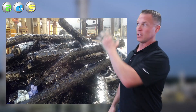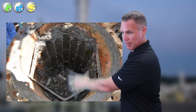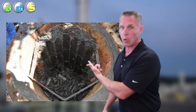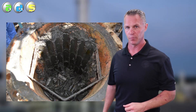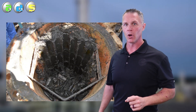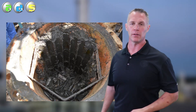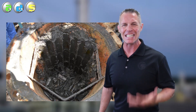You just get mackinawite, or lean amine filters that look like black shoe polish. If your lean amine filters are continually plugging off with black shoe polish, increase your regeneration - drive the H2S out of the amine and you won't have this. No iron sulfide, no plugged filters. So the key is: you do not form a protective film on the lean side when you leave H2S in the amine. The only iron sulfide you form is mackinawite.